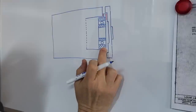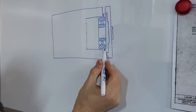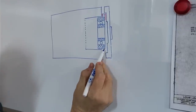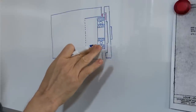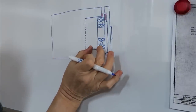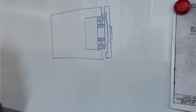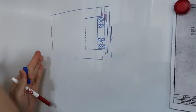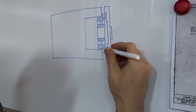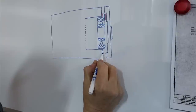That's right. Okay, so the bearing you buy today looks like that. You know, there's no flange or anything. It's just straight. Obviously, we can't use a new bearing like this as is because there's nothing to hold this from moving in. It turns into a missile launcher. Right. If you would assemble your spindle this way, the spindle's just going to fall right through the back. So what we need to do, as we explained earlier, is make a little groove and then add a retainer ring right here.